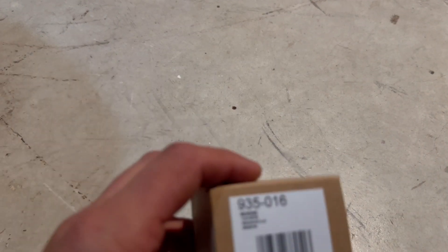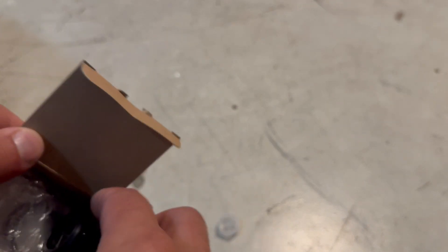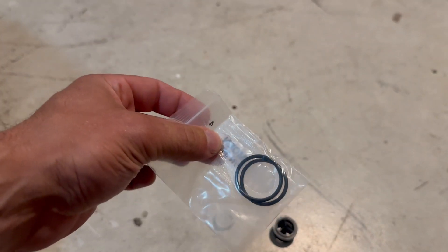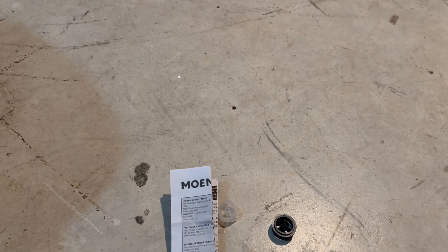I was able to contact Moen and tell them the problem. All I needed to do was submit a picture of my unit so they could verify the inlet size, and they sent a replacement part out to me free of charge — didn't even have to provide any proof of purchase. I'm going to walk you through today the simple replacement of the turbine on your Moen Flow unit. Here's the part number for the three-quarter inch valve straight from Moen. You can find this online for about ten dollars, but if you contact Moen, they'll give it to you for free. It comes with the plastic impeller, the cover piece that holds it in, a package of two new O-rings, some O-ring grease, and install instructions.